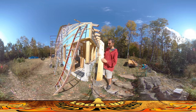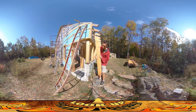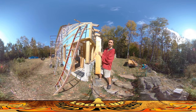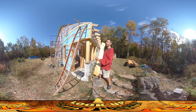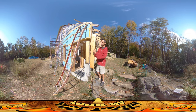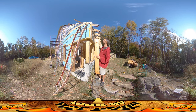The way I'm arranging these — these are shiplap boards — is you put one down, then you put the next one and it overlaps this little tongue, and it keeps going like that. I'm orienting them in this direction as opposed to the other because we get most of our wind coming from the west generally. If you have a hard driving rain with the boards one way, the wind would tend to blow rain down into the crack, but oriented the other way the wind would tend to blow the rain past the crack. Generally more often than not that's the direction the wind comes from, so that's the way I'm orienting the boards.